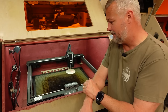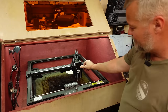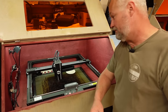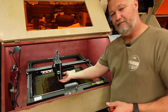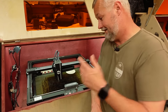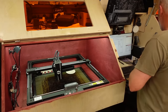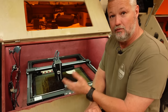Cable management — they did a great job. It comes with drag chains already on both axes. Some machines have a clearance problem from the gantry to the workspace; this one does have drag chains underneath the gantry. Keep in mind the module is probably going to be the lowest part of the machine. It travels from zero to 40 millimeters, so it'll only come up 40mm off the bed — that's about the max material thickness without raising it up or adding legs.